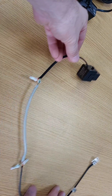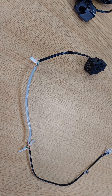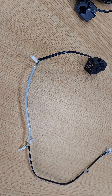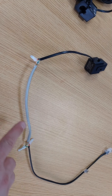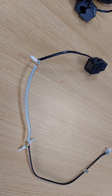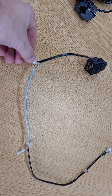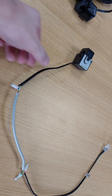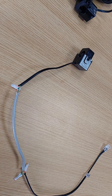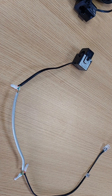Using the cat5 cable and the relevant crimps that we supply inside every box, the CT comes with a red and a green cable inside. To keep things simple, use the green core of the cat5 to the green cable of the CT, and for the red cable, use the orange — it's as close as you'll get. Copy this on the other end as well, twist the cables together, and then test them to see if you're getting a reading.